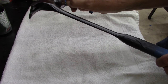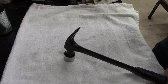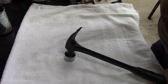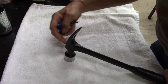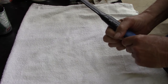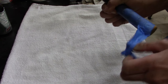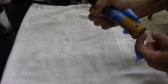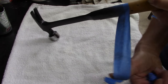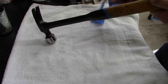Now somebody out there is gonna say you shouldn't have heated it with a torch and bent it and taken the temper. But the more I think about it, these hammers can't be tempered that much. For one thing, if they were hardened, the first time you hit another piece of steel, you'd break something. So I think what I did would be just fine. Now, how do they bend it? I have no idea, but somebody definitely bent it, and who knows, they put a cheater bar on it.